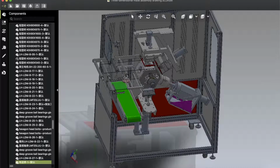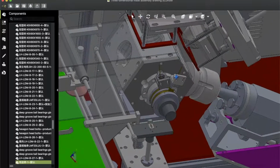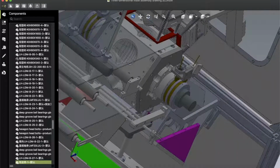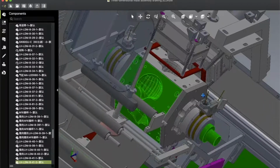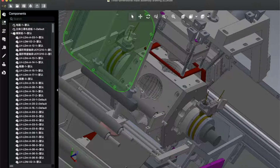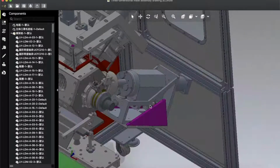Okay, so if I zoom in a little bit, then you can understand and get the shape here. Okay, here you can see the cup type mask shape, and when the mechanical head push on it, the ultrasonic machine push on it, the fabrics just get shaped by the pressure of ultrasonic and by the pressure of heat. Okay, so that's the main mechanism.